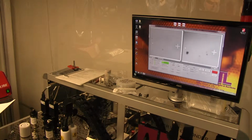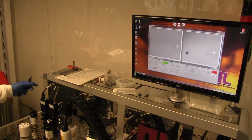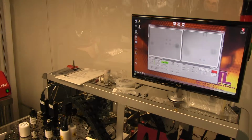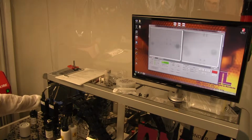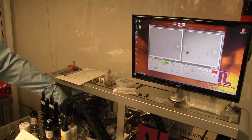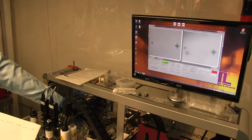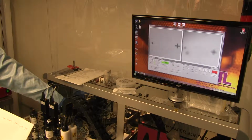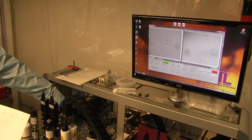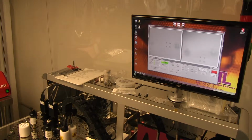It's okay, and they're nicely in view. Yeah, actually, as you found the marks, you can probably just focus on the lower marks there. One other thing I didn't mention. When we focus on the upper marks, you'll see that they're white. If we get the right level of focus, that black cross is a shadow of the upper mark on the lower wafer. So that can confuse you. We need to ignore that one. Focus on the lower marks, which are those squares. So be aware that that can happen. You can see shadows and you can see reflections sometimes.